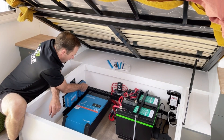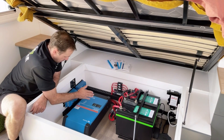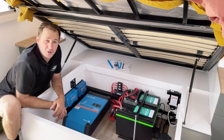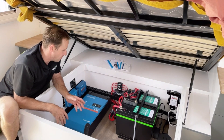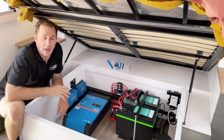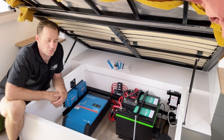There's 400 watts going through this one - two 200-watt panels - and we've strung up another four 200-watt cells through the 50-amp controller. So 1,200 watts of solar on this, that's six 200-watt panels. Huge amounts of power. That's enough to keep up with the air conditioner during peak hours and charge the battery at the same time. That's unheard of on most 20-foot vans.